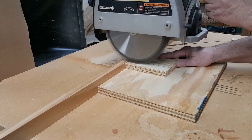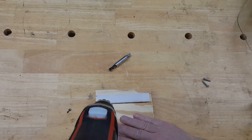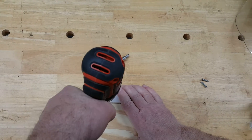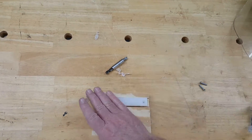I cut a three-quarter inch wide dado an eighth of an inch deep for the guide. A pin located an inch and a quarter from the blade, which is the radius of the insert, would serve as the center around which a piece of wood was spun to cut the circle.